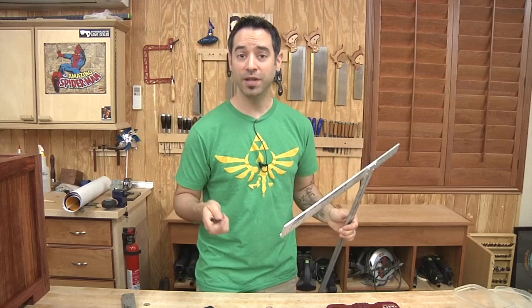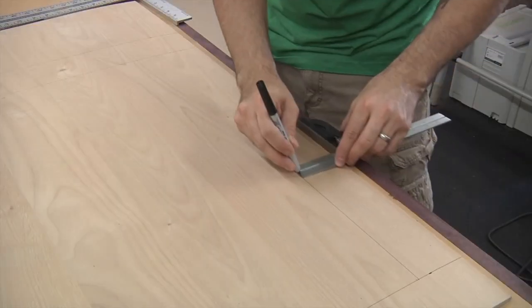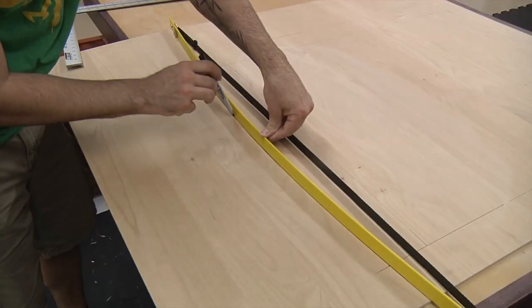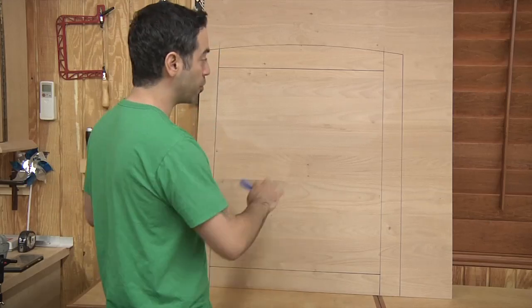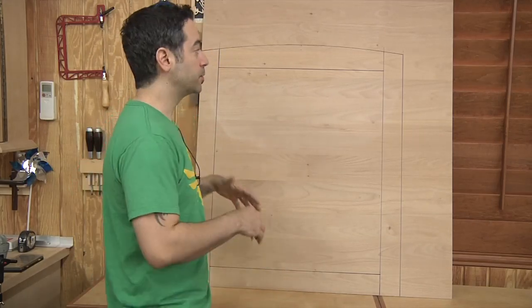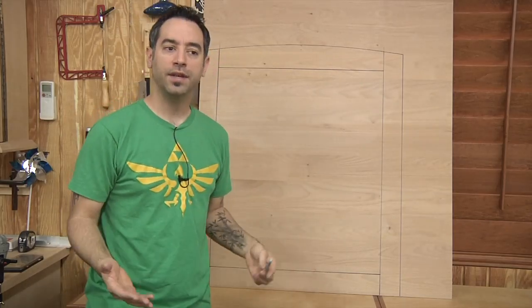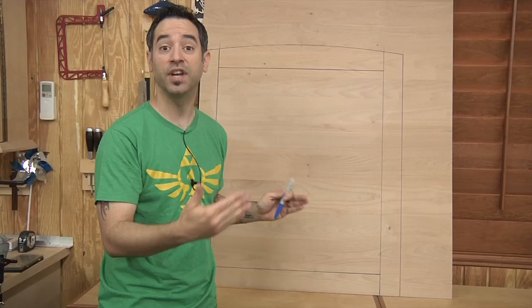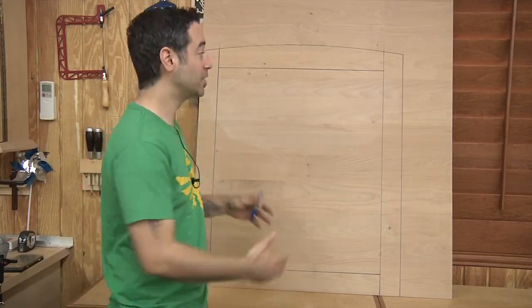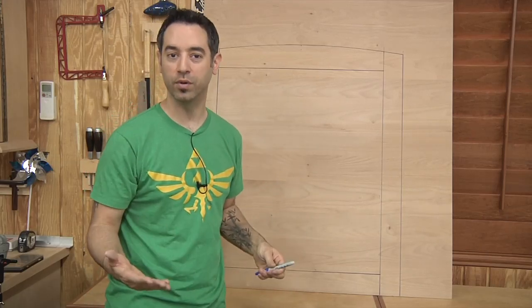All I need now is my trusty drywall square, a pencil, and a piece of quarter-inch plywood to do the drawing on. I'm really pleased with the way this looks — it's got a nice simple elegance to it, the proportions look good to my eye, and I think it's going to look really nice in the bathroom. A lot of times when you design a piece like this, you should be thinking about whole number proportions or the golden ratio to help decide on relative lengths. In this case I'm abandoning that, because I want this to fit in a very specific location for a very specific purpose — functionality sort of trumps a traditional theoretical design number.